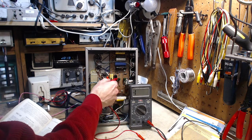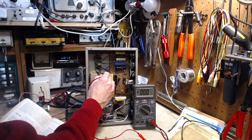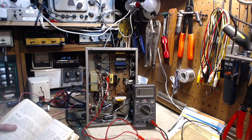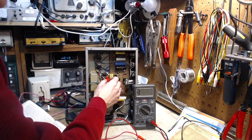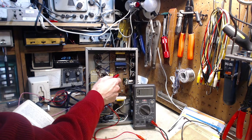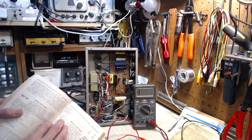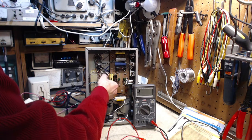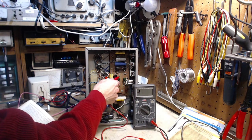Watch now. These are the two capacitors I replaced that I think are the coupling capacitors. There's the zero — and the other one? Nothing. Now, to get an inverted signal, a couple of ways to do it with a tube like this. One way is you take a signal off the top of the tube off the plate circuit and a signal off the cathode circuit. So if I move the clip lead — it's this capacitor, not this one. The signal would pass through it and go to one of the two output tubes. Now let's look at the cathode. The cathode that's related to five is six. So we get off five, we go on pin six. Okay, we're on pin six. Same capacitor — nothing. Other one — there it is.